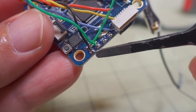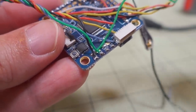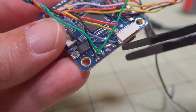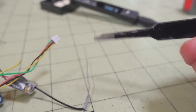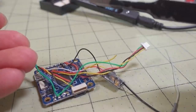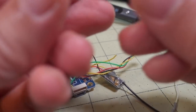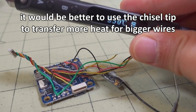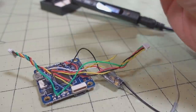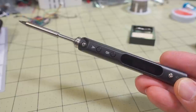I just did a couple of wires and yeah, it works just fine. The iron itself is very light so the handling is a little bit different, but really no complaints. I'm working with very tiny wires here. If you're working with thicker gauge wires like an XT60 connection - 12 or 16 gauge wire - you're going to want to hold the iron down on the wire longer, or raise up the temperature from 350 to 400 degrees. As long as you do that and make sure enough heat is getting into the wire, the soldering job should work just fine.